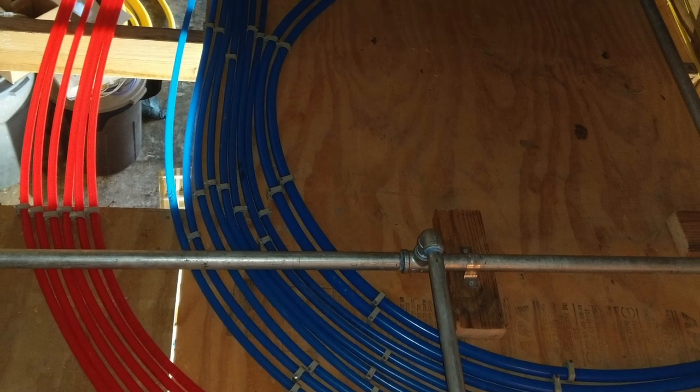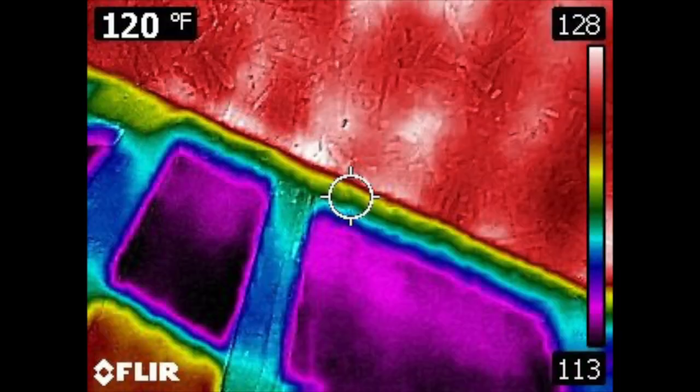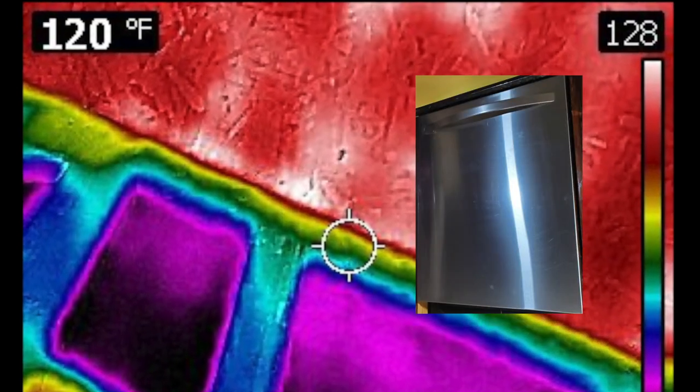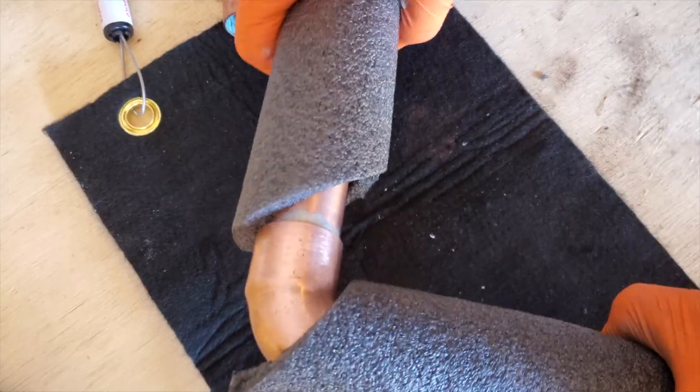A hot or cold water supply line charge might not be a big deal if your plumbing runs through an unconditioned attic in the summer and your dishwasher's in the attic. That does not happen for most, the dishwasher in the attic part, that is. Insulated pipes can help with maintaining operating temperature after use, but insulation cannot keep stagnant water from falling below 120 degrees Fahrenheit when running through cooler spaces.